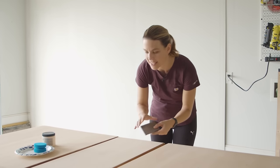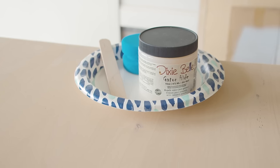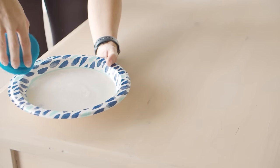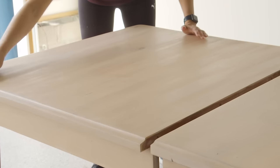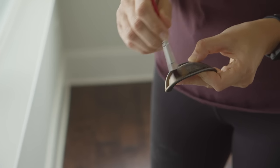I have let this dry overnight and this color is absolute perfection — I've never got to use this color stain before and I knew I was going to love it. Before I topcoat, when you do a water-based stain it feels a little rough, so I'm going to sand it back a little bit with a really smooth sanding sponge to prepare it for my topcoat. I'm going to use Gator Hide because this is perfect for high-traffic areas. I'm applying it with a sponge in long strokes — I don't like to shake it because that can create air bubbles. After letting this dry for two hours, I'm coming in with that same sanding sponge to do a light sanding between coats. As a finishing touch, I'm taking a galvanized pull and making it match the table using gilding wax in the color bronze.